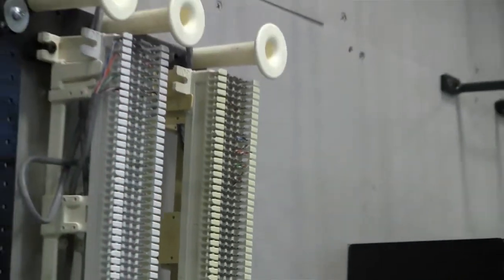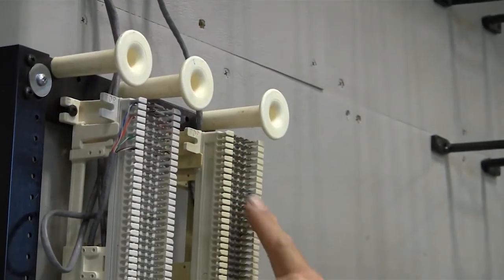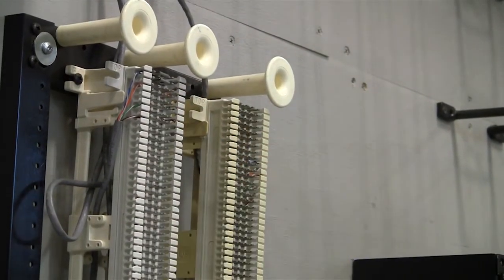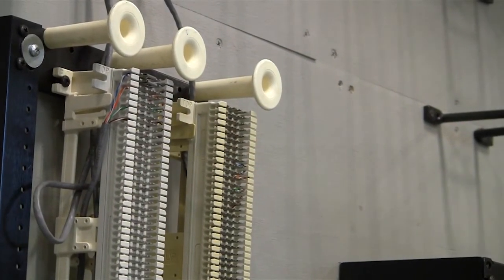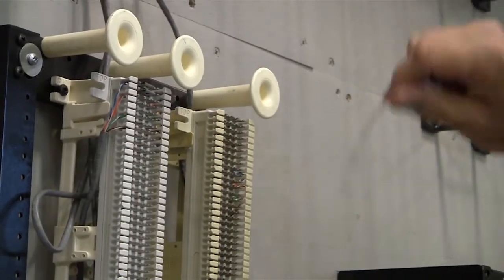And when we're doing this now, we have to get phone service. This is phone service over here. We have to bring it in over here. It's called a cross connect. And in the case of telephone, we only need one pair. So we'll use cross connect wire.